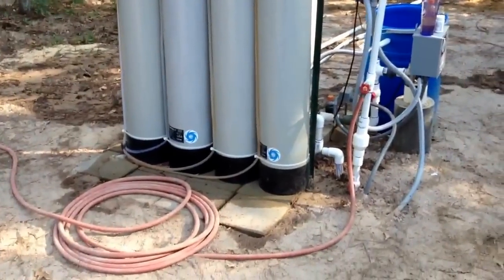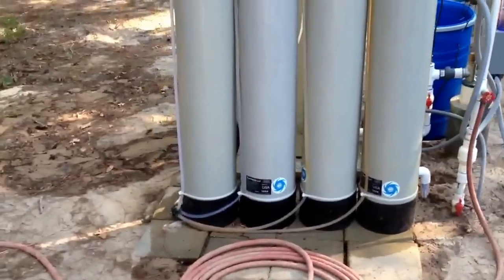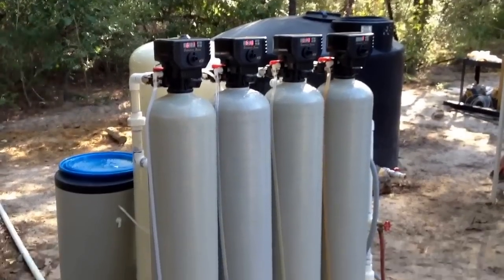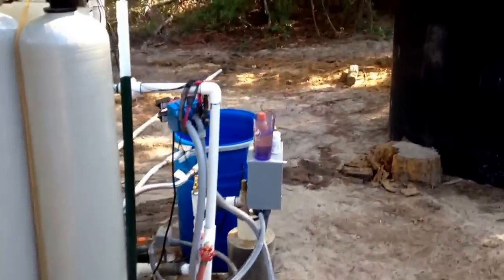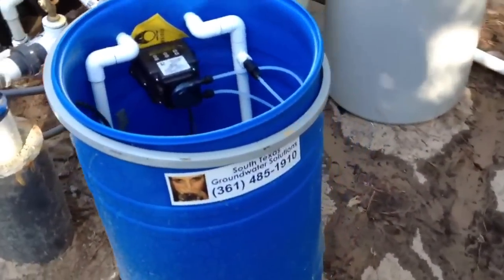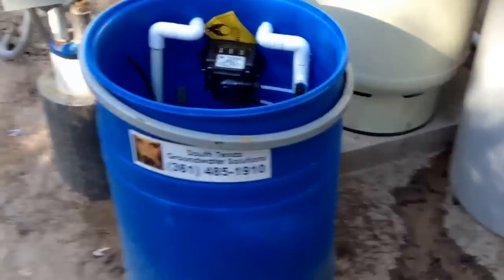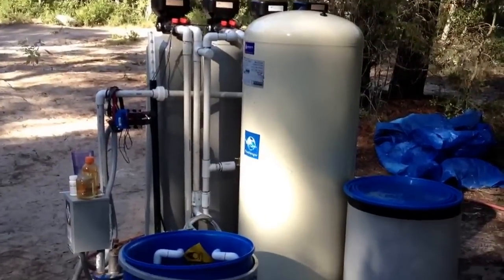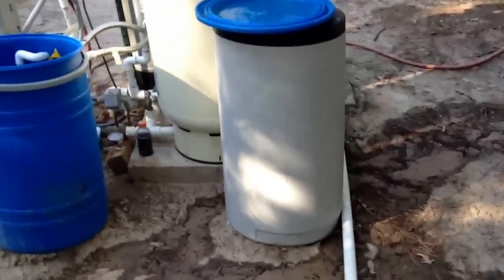They do make multimedia filters, but they do not work as well and they require a lot more frequent backwashing. I am into water conservation and do not like to waste water. So the backwashing every day was unnecessary — we were using the tanks to settle out iron. The groundwater repair kit took care of all that; there's no more need for it. Not only that, even if we were just settling it out, this is also sterilizing the water with 35% food grade peroxide.